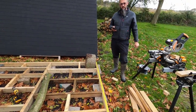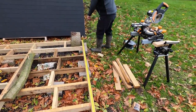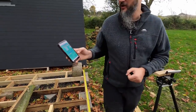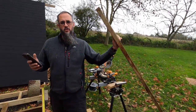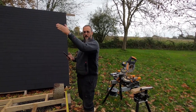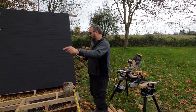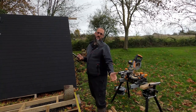Now I need to work out the angles. We've measured the length and it comes out at 250 centimeters. Working in right angle triangles, half of that is 1 meter 25. Using a right angle triangle calculator online, I know we're using spans of 2 meters 40 piece of wood, so from that I can work out the length to 90 degrees up, which gives me the angle. It turns out that the bottom angle A needs to be 58.5 degrees on the mitre saw, and the top one needs to be 31.5 degrees — so that one plus that one plus 90 degrees gives us 180 degrees total, which is a triangle.